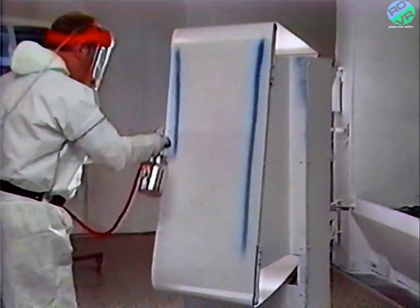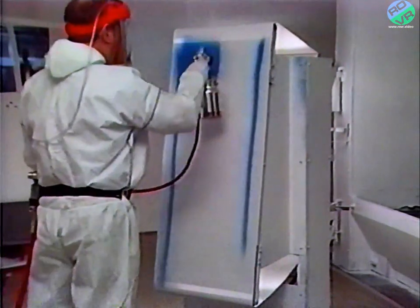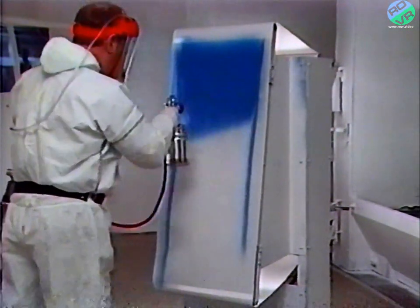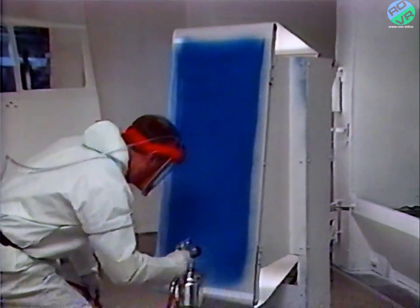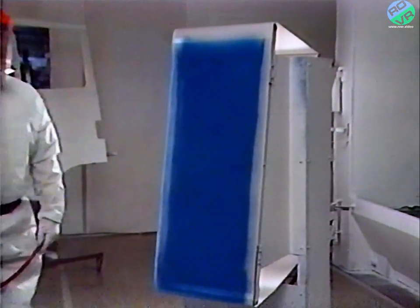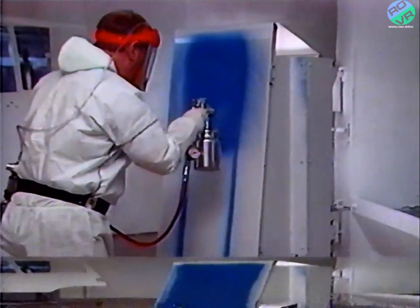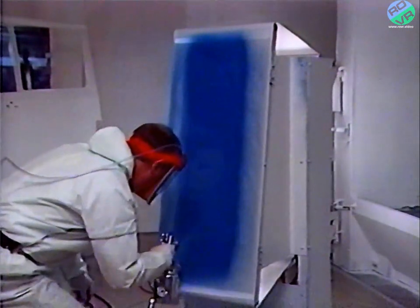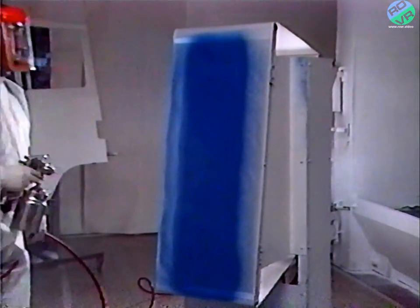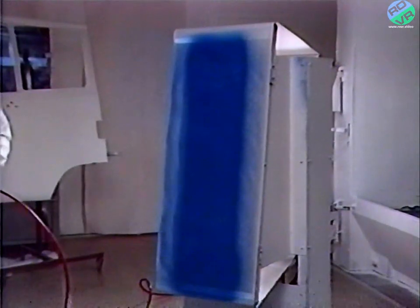With the JGHV high volume low pressure gun, you'll notice a marked reduction in the amount of costly and troublesome spray fog due to the reduction in forward velocity, which reduces the bounce back and wastage. At the conventional JGA's operating pressure, air which hits the surface bounces back and prevents some of the atomized material in transit from ever reaching its target.